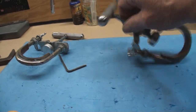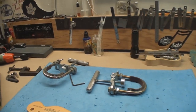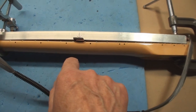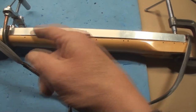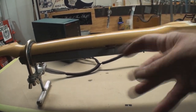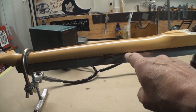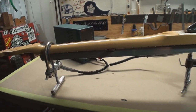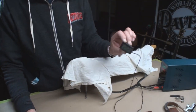Let's clamp it up. All the clamps I made - that's part of what I'm trying to perfect. Clamps are clamps; these are kind of brutally steampunk but they do the job. We're all clamped up. The camera doesn't do this justice and sort of distorts things, but I have pushed this neck into the smiley face direction we'd like to see and tightened the hell out of the truss rod. Let's cook it. Physics says hot air rises and heat radiates, but when I tell you how this is constructed you'll understand there's a hot side and a space side in there.